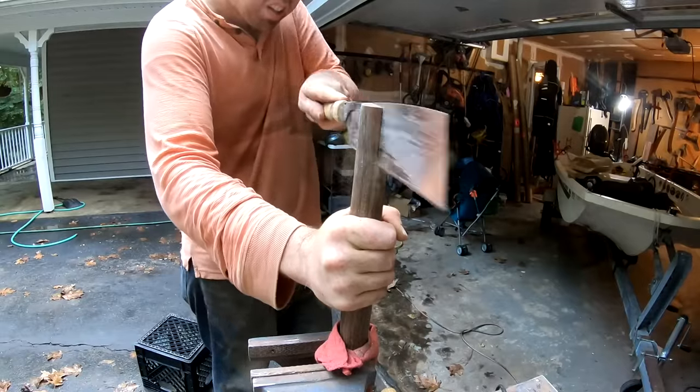Now we're going to get some boiled linseed oil and get this thing shiny. The fun thing about boiled linseed oil is it acts like a lubricant when it's fresh, but after it's sat for a little while it gets sticky and then turns into an adhesive. So it's great for putting on axe heads — it helps them slide right on, and then after it's been on for a little while it starts to get sticky and makes it hard for them to slide off.